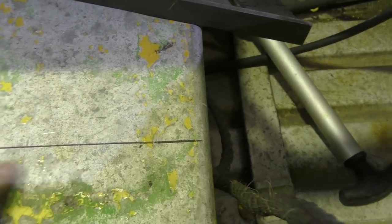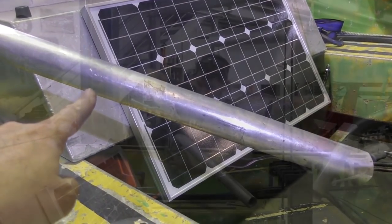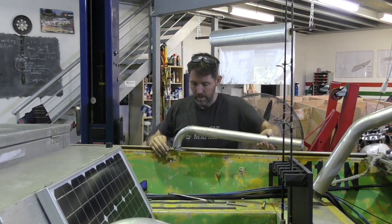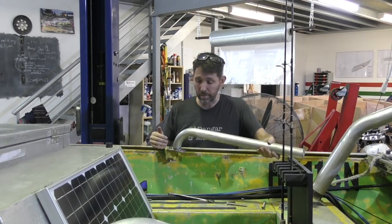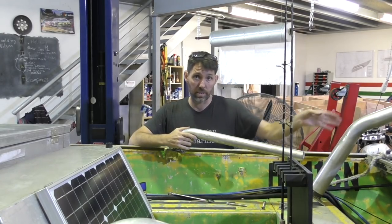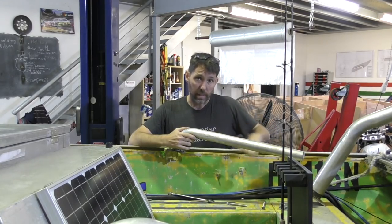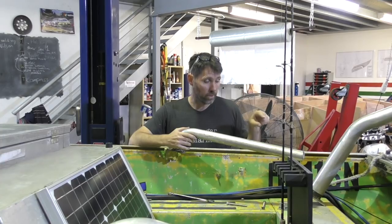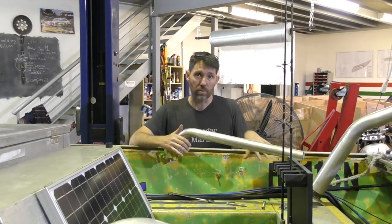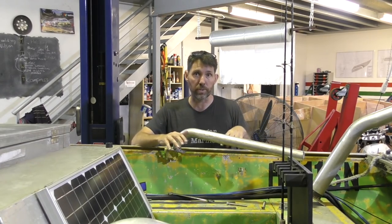I've measured the width of the bar and the width of the seat — I need to come 140 millimetres in on each side to make it centred, and I've used a speed square to give myself a perpendicular line. I'm going to tighten the bolts that hold these arms on a bit — not super tight because I need to get the angle right first — but at least hold them roughly in position. Then I'll take the crossbar off, use the flap disc to clean the seat I'm going to weld it to, temporarily screw them down to hold them in position, and grind the flange on the crossbar clean before bolting it down so it's all good to weld.